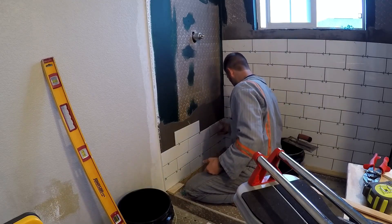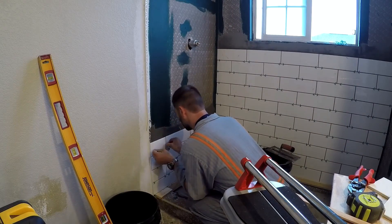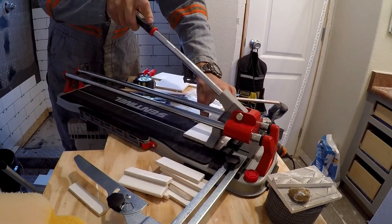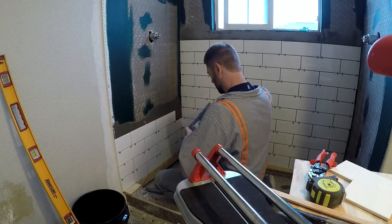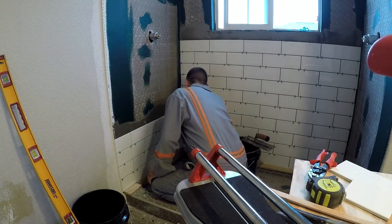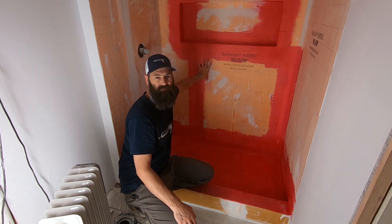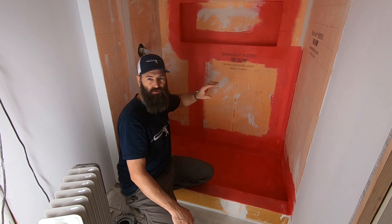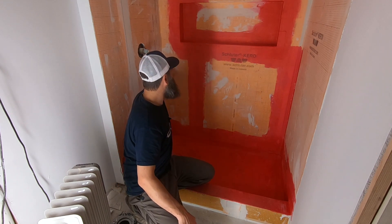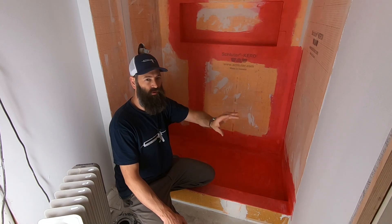There's a lot to discuss about showers. When I started building houses around 2005, all the bathrooms just had green board — no mesh tape, no red guard in the corners, no nothing. It was just green board screwed up just like drywall, and the walls tiled. Now that was with the tub. You don't get water penetrating through your grout joints, through the thinset, and into the wall board. So this area up here is a very low concern for a leak or mold.